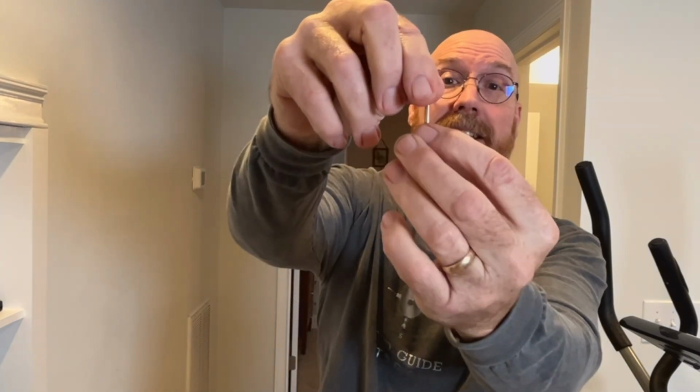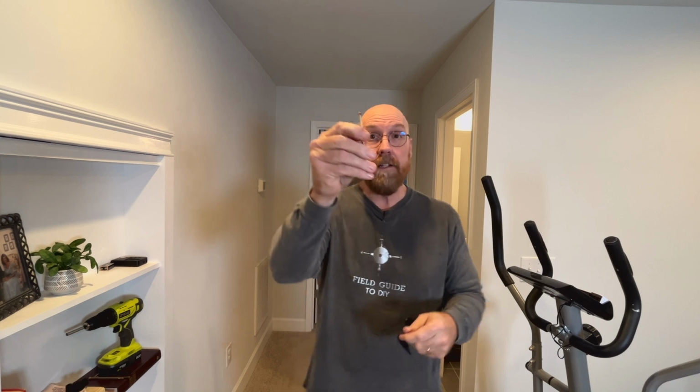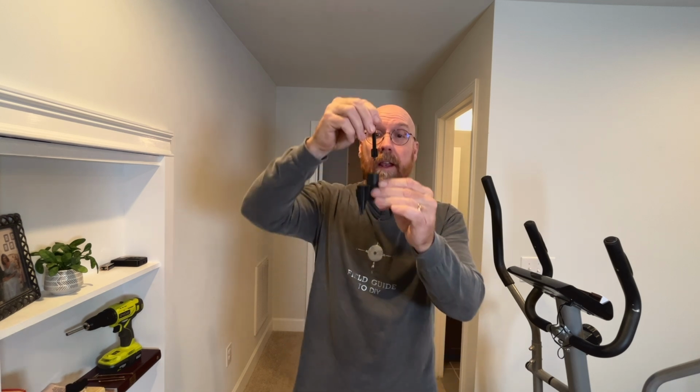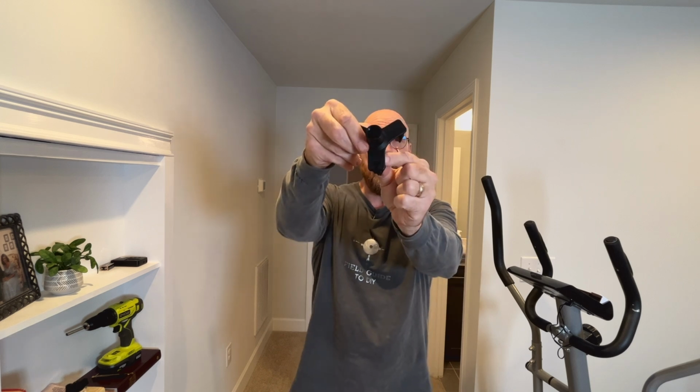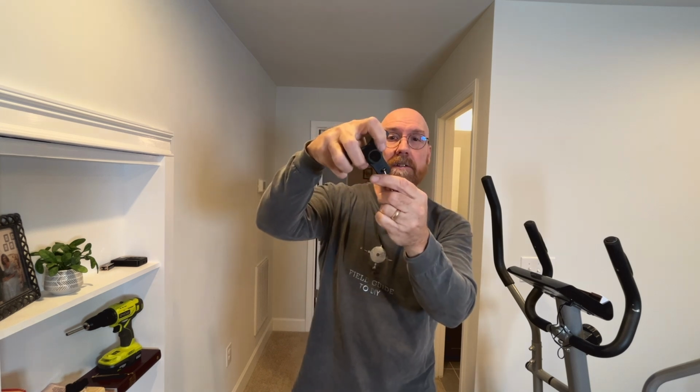But the secret to this setup is this screw. That's right, it goes down into the wood only so far and then has a breakaway tip. And how far do you drive it in? Well, that's what the jig is for. You take the bit that they provided with it, the bit will not go in any further. Then when the screw is in so far, use the screw gripper to grab the head of the screw and twist it off.